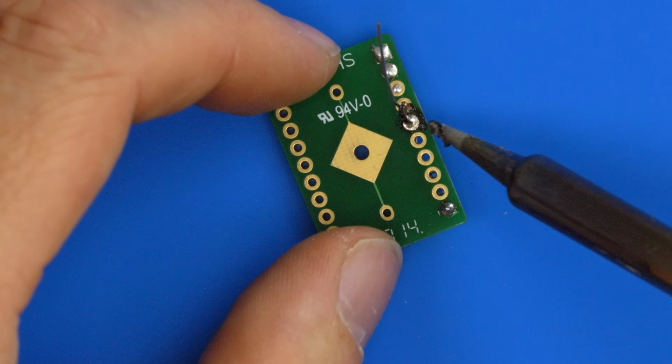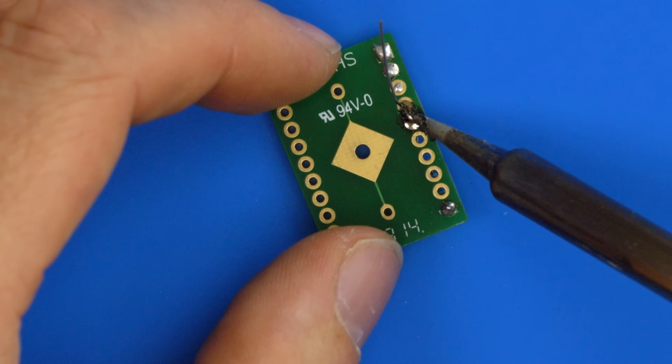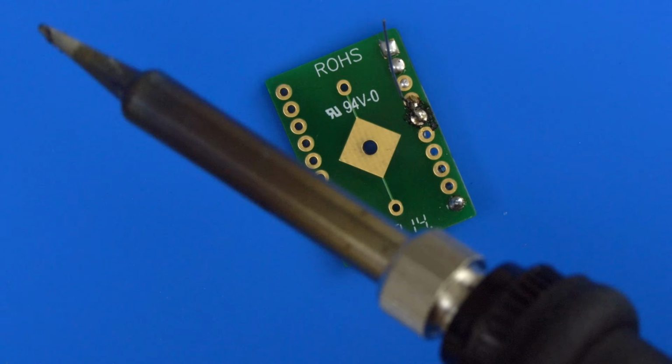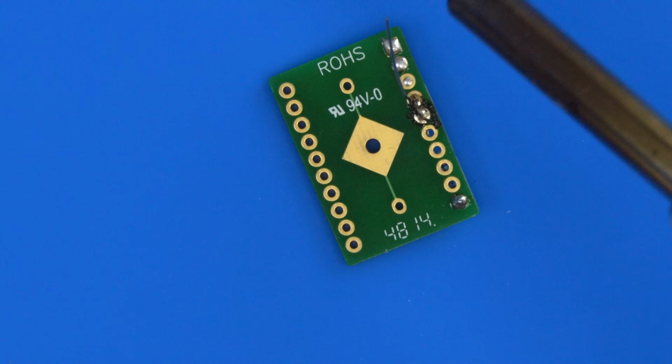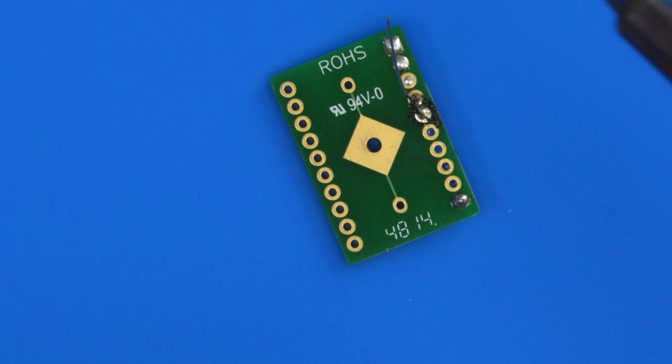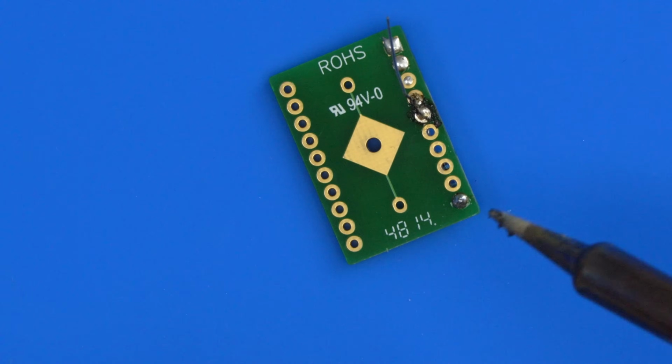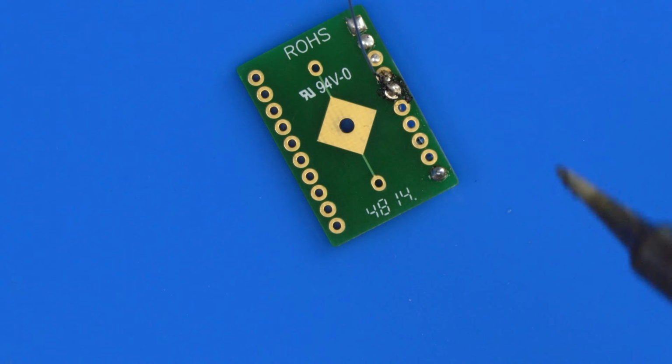So that's a hint at what is happening if your solder melts but you're getting all kind of mess and things like that. Turn your iron temperature down. And I'd recommend really starting with the lowest temperature that melts the solder until you're used to soldering. And you should get joints similar to the first.